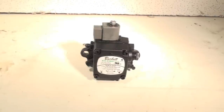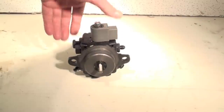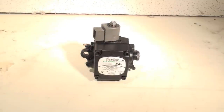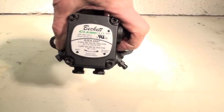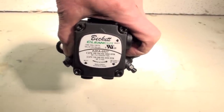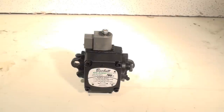This one is on the mini pumps — these are oil furnace mini pumps. They have a little solenoid right here, which is a cut-off solenoid. It's your drive shaft for your pump, and the fuel line comes out of here going to the gun burner. It has this little solenoid here — a solenoid valve built into this pump. This pump says it's made by Beckett, but it's actually made by Suntec, or Sunstrand as it used to be called. They call it the clean cut, because it's got this thing built in that does not allow the oil to pass to the burner until you get up to the set pressure.